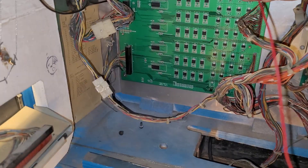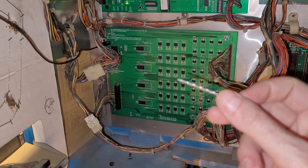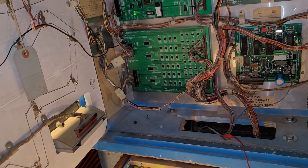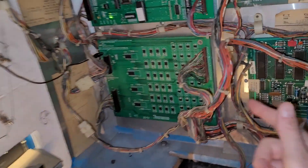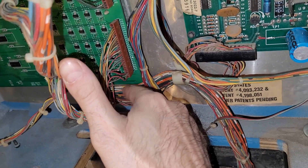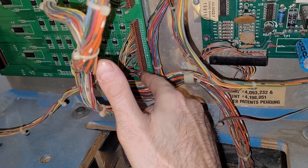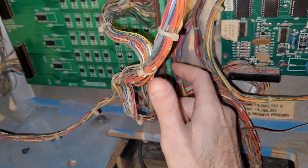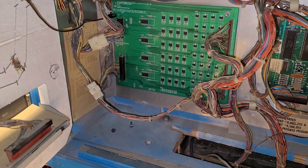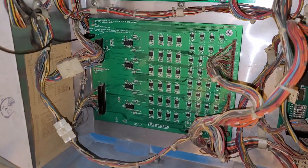You'll see that my suspect light is turning on. You can also do that with the middle leg, but I'm not going to try that because I might short something out. So if you're sure that your socket and bulb are good and that your connector is good — I repinned initially the wire that I thought was suspect and it still didn't solve the problem — sure enough, when I did this to the suspect bulb it illuminated, so I knew that SCR was bad.